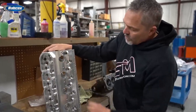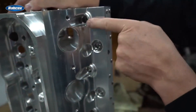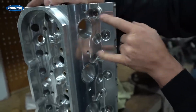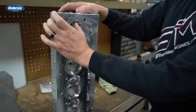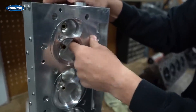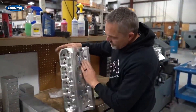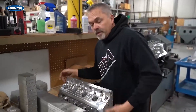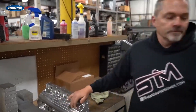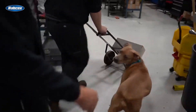We have our own valve train for this whole project. O-ring exhaust ports — you can see that. Because we've moved the pattern, this is a half-inch head stud, not that little wussy three-eighths 10-millimeter stud. We've moved the pattern especially on these two holes, so it does come up and makes a really close intersection right there, but everything in this deck surface is solid — nothing in this deck surface is less than about an inch and a half thick. Billet, ultimate clamping force, very good port design, combustion chamber design, built to take the boost. Making horsepower is easy; making it live is hard.